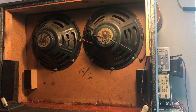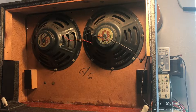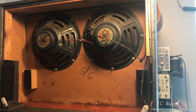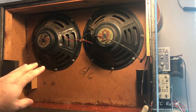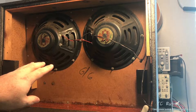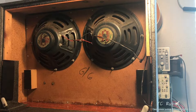This video is going to be a continuation of the first five videos in this series on the restoration of the Sears Silvertone amplifier. If you haven't seen those videos, click up here to take a look at them first. In our last video, we were doing the final demonstration with a guitar, and we were able to hear that there are artifacts in the speakers that didn't belong there. Hooking the amp up to another set of speakers, we hear the amp is running fine and the problem is in the speaker cabinet itself. It's time to dig in and see what the damage is.